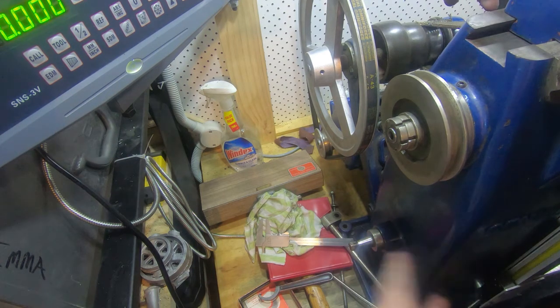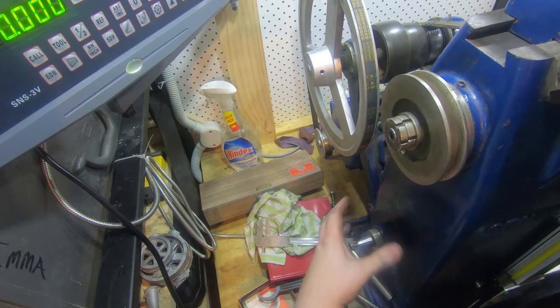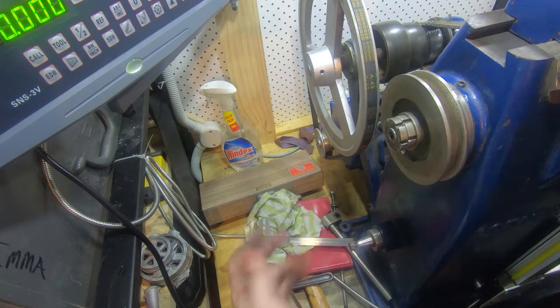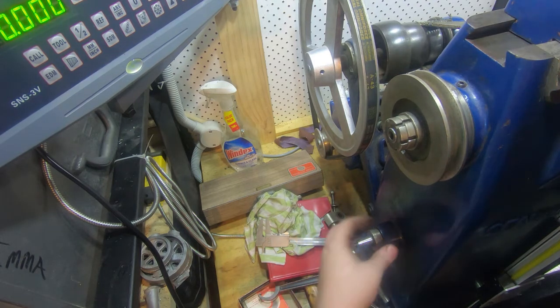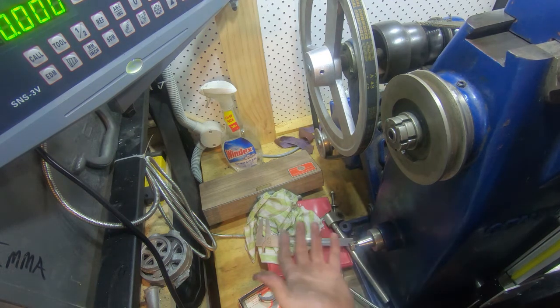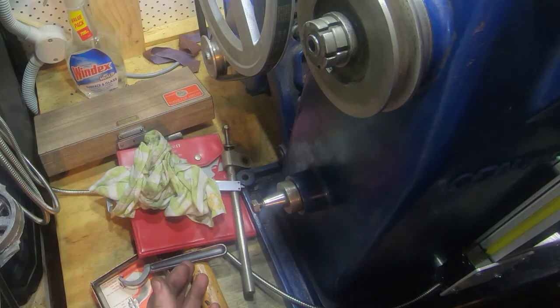Not so sure about that — anyone got any ideas? The Centec 2A — which was a different casting, I imagine — had a big enough boss on here, or it had the casing for the worm drive which was probably almost integral. So that's what I need to do. I've ordered a Japanese wheel and worm from KL, so when they come it's probably a fairly straightforward job to machine the taper and get that to fit on there. Making a housing that aligns on this — probably the best way is to make a bearing on this. That's going to be a bit more tricky. Probably an aluminium ring that bolts on there is probably the best, like I've said. Anyone got any thoughts? I'd really appreciate it — you've been more than helpful with this mill. You've got some great ideas and I really appreciate everyone's input.